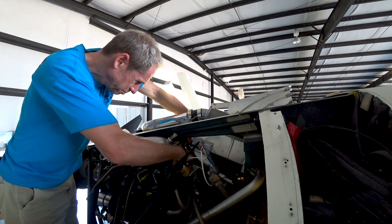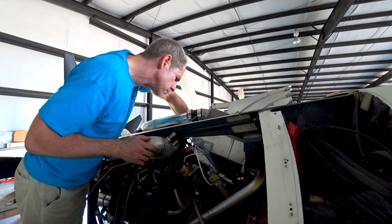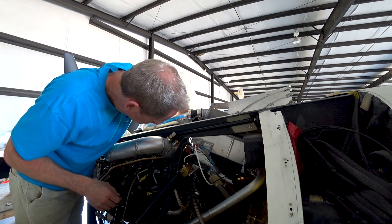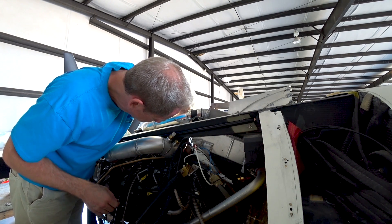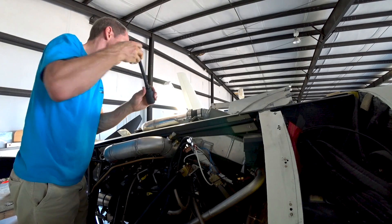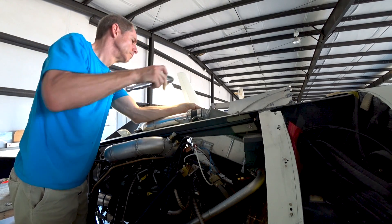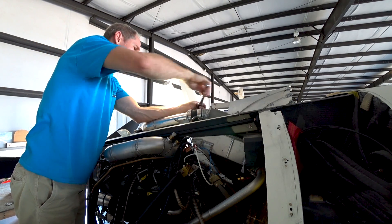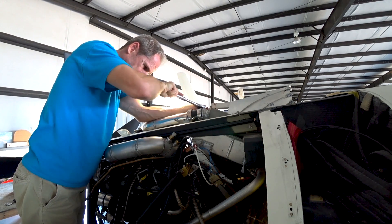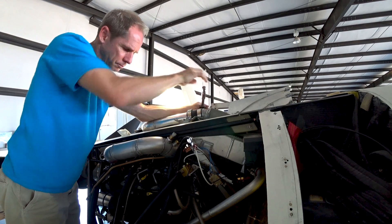So that problem's double-checked. Obviously I hadn't started the engine yet, so there wasn't really any oil in the filter — I didn't make a mess. I'm glad I bought that 32mm socket for that, because you could just use an open-ended wrench, but it's much better to have a socket with an extension so you can come straight down on it without trying to get in around all the other stuff. It worked out well, and now you guys can all rest comfortably knowing I've got that filter in there correctly.